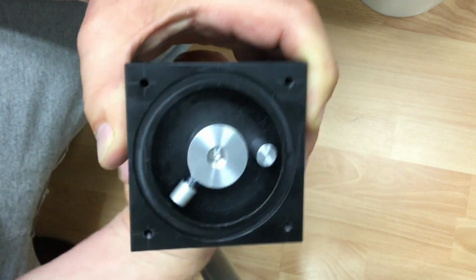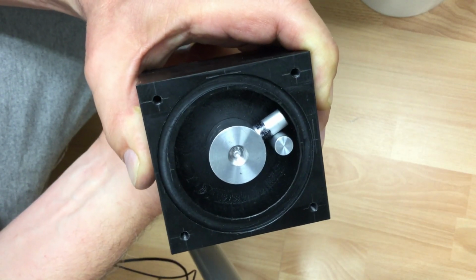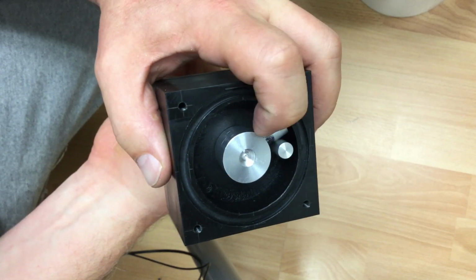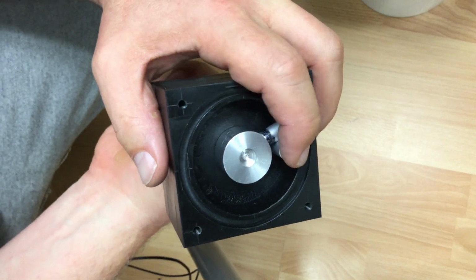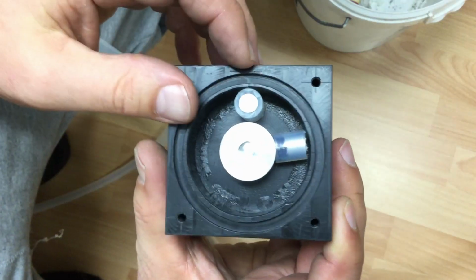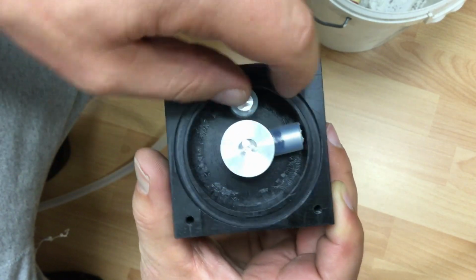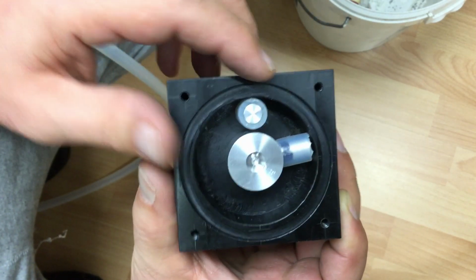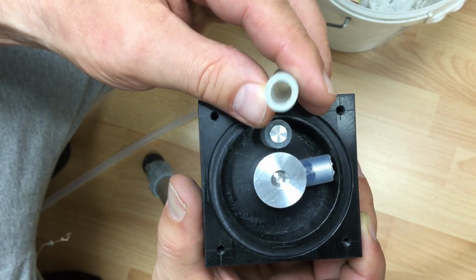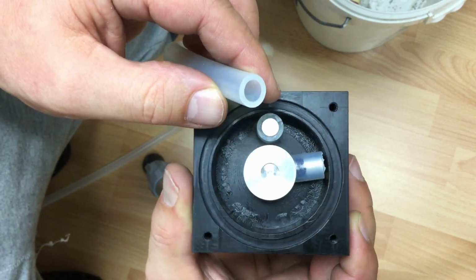And here you see the principle of function to limit the rotation. All that's left to do is create two millimeter thick silicone sleeves for both the stop bolts. So the silicone tubing is in. It just acts as a little buffer if you turn over hard the wheel, and that's just some silicone hose which I bought way back. Cut here, link in the description for this project.